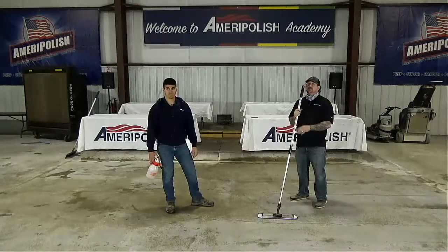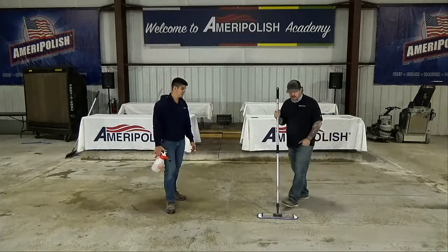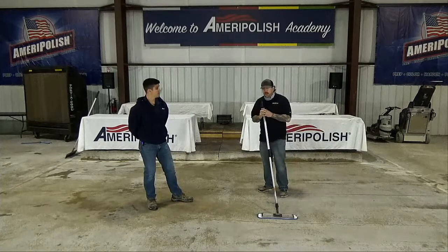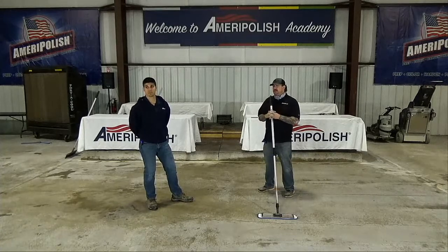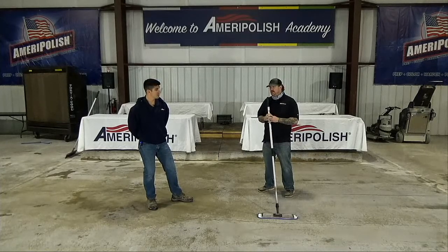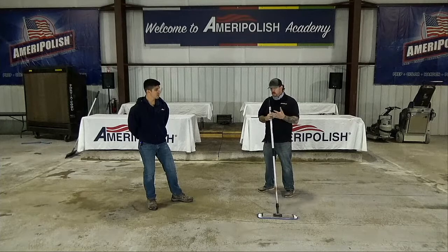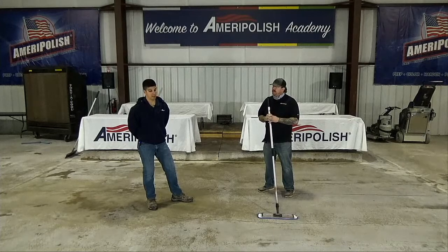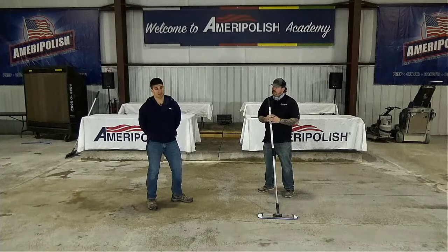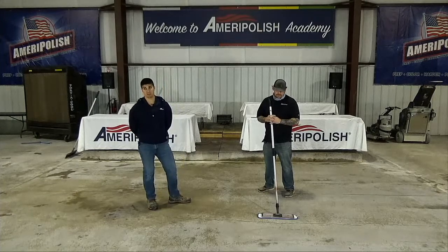All right, so we put it down after the double zeros. We typically don't go up any higher than that before we put it down. If you get into your ones, twos, and threes, it's not going to cut the densifier film off with that step. It can make the ones, and definitely will make the twos, skate across the surface and not do what they're supposed to do.